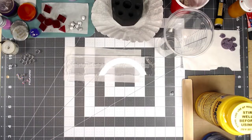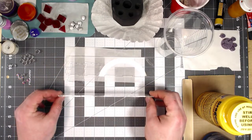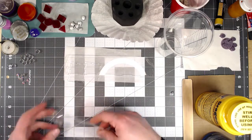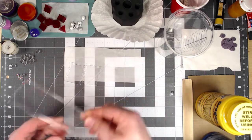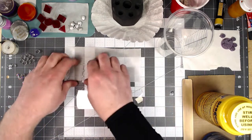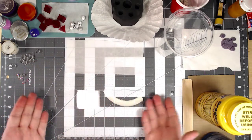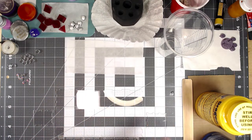The cool thing about this mold is that you use the same 4 pieces for the top and the bottom. You'll put the tape on the one side, and then once it's done, you'll pull everything apart, cut your keys, your registration marks, pull your keys, get everything ready, Vaseline, and then you will put the bottom piece on, flip it around, and then make the top piece. And you'll see that here in a few minutes. So what I'll do is I'll put it together, and then you'll see.